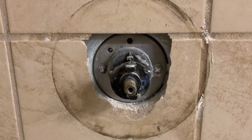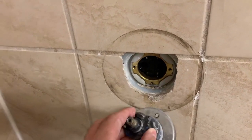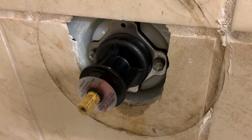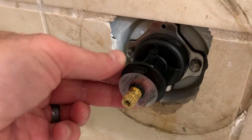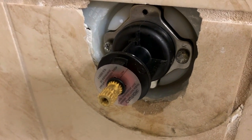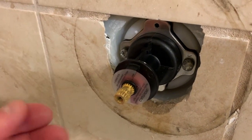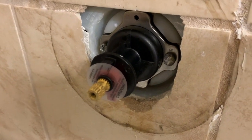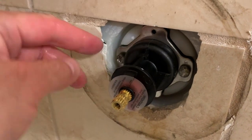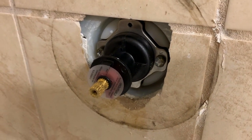Water's been isolated and we're going to take it apart. The screws that were on the left and the right side here were removed. I replaced the outer control valve here. After isolating the water I left the internal parts in place — that wasn't necessary to fix this mixing problem. It was just in this piece here where the hot and cold water was not being properly blended to give you a good medium temperature. So I just reversed the steps, put this back in place, tightened the two screws, turned the water back on. I've already tested it and now we're ready to reassemble the valve.